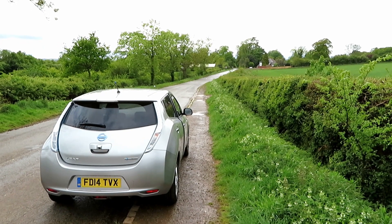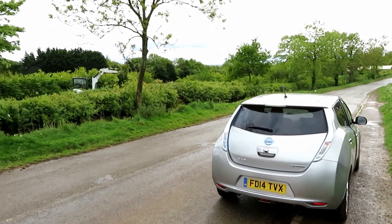Let's go to site. We're here at location test A. I've been playing around with the app on this phone, opening it up a little bit. FRS and PMR446 are OK; about the lowest I could go was about 400 MHz on transmit, and the highest was about 500, but I believe that's just the app restricting it. There is firmware you can download with that hacked app which will give you more frequencies should you so desire. I only wanted this to be able to operate on the PMR channels, but it's just great that we can now do that. So we're going to test this against the KDC1 and the GT3 at two locations, weather permitting.